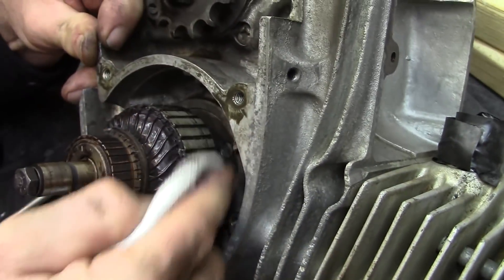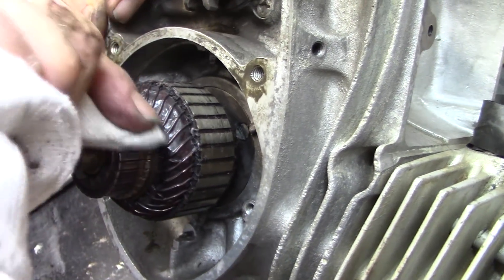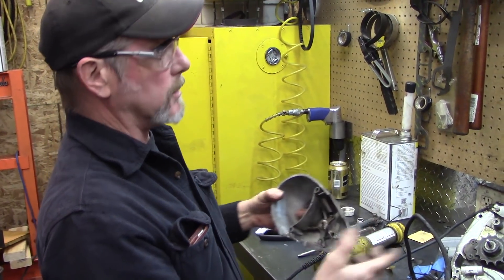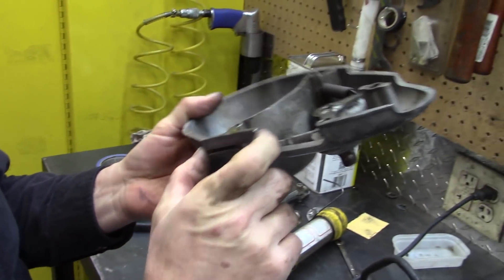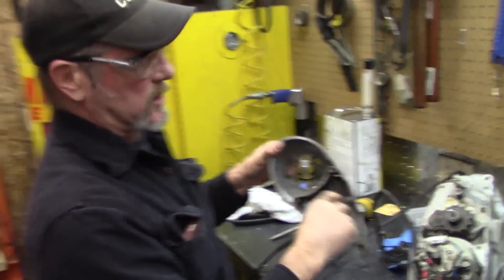These are all insulated in between. As these brushes are on here, all these windings come and it's on-off, on-off. I just took all the springs back out of it, slid the brushes back, and slide it back over that. So as the clutch lever's up here, it comes around, goes to the opposite side of the bike, comes through into here. The cable has a spring in here, and as it's going you'll see how it's ramped — that gap gets bigger back here. It does a quarter crawl on a screw thread or something. That's what pushes this rod in here and goes across to the other side, and that's what disengages your clutch.